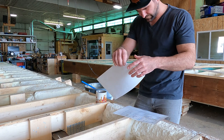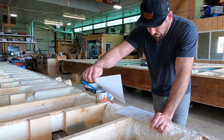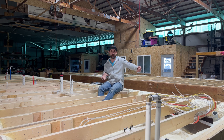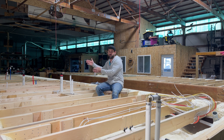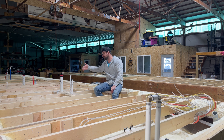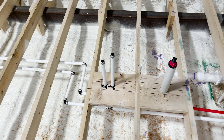Next, I take my blueprints and double check all my measurements. On my blueprints, I make sure to put in extension marks from a central location — I pick one spot on the trailer and pull all my measurements from there. That way I can walk down the whole unit with a tape measure and double check to make sure that everything coming up through the floor is exactly where it needs to be.